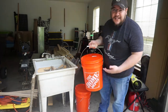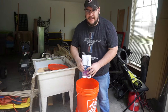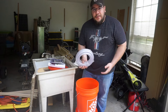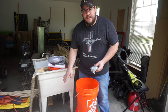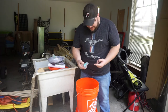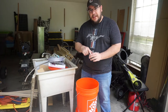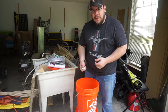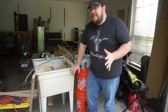You're also going to need two buckets, at least 5 gallons each. You'll need a household string filter along with the actual filter mechanism, some caulk, and a hole saw or some way to cut a hole in the lid of a bucket. You'll need a couple of lengths of tubing and connections for that tubing specific to your pump. I've got a half-inch male connection into a garden hose adapter, and on the other end another half-inch connector going into the water line. I also have some fittings and grommets for air sealing. Overall the total cost for everything was around $250 to $300.